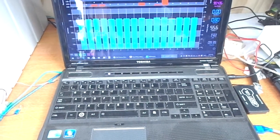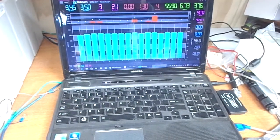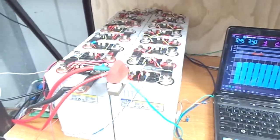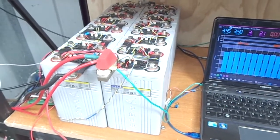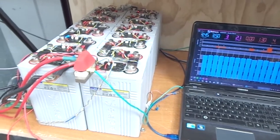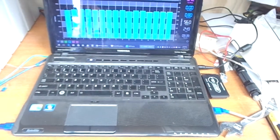The plan is to fully charge them. I came out earlier in the week and with LiFePO4 cells it's hard to know the exact state of charge unless you're using something like the Batrium that has the shunt and measures the amps in and out. I wasn't really sure what state of charge they were at.